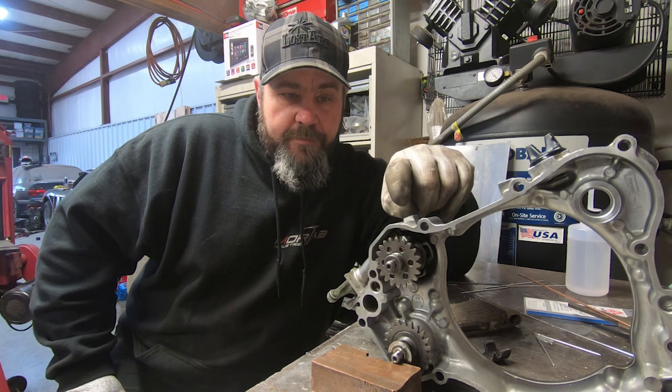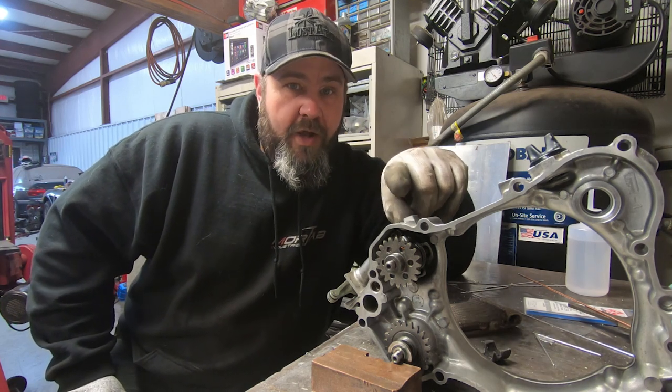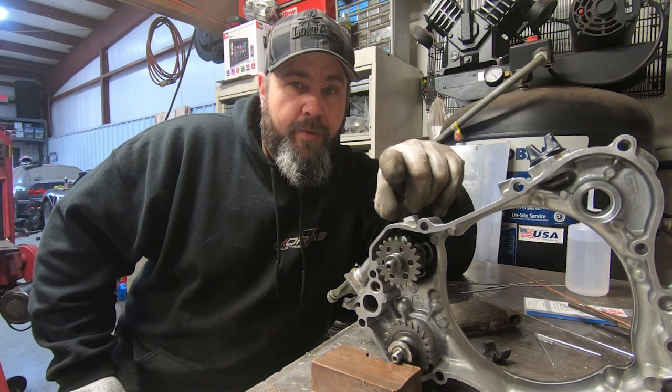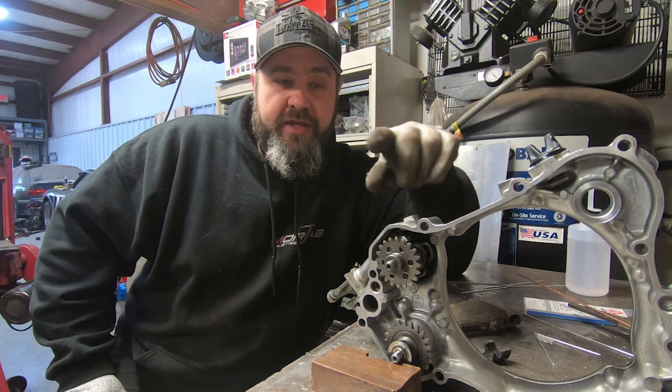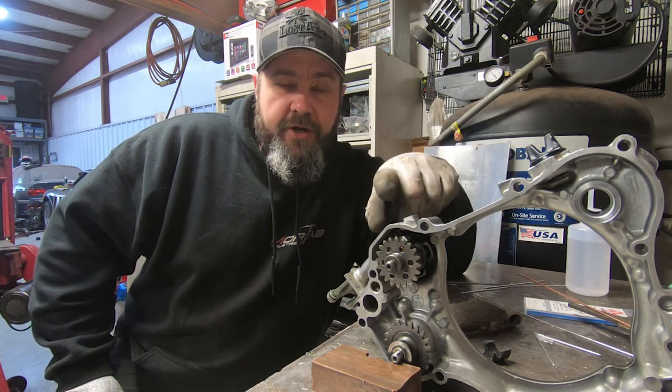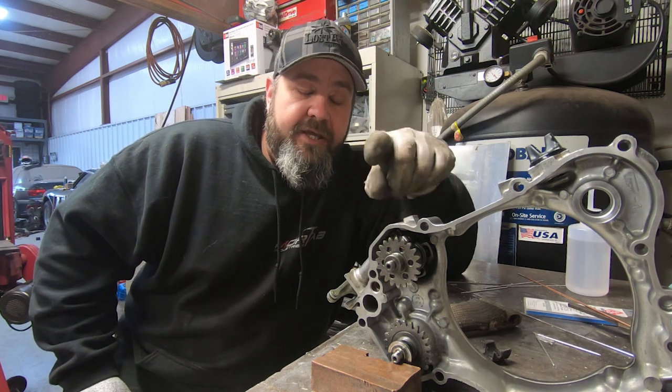and we're going to reflow all of this cast aluminum. And by reflow it, I mean when we start welding on this, what's going to happen is you're going to see a lot of pores and stuff popping out of it. You might not be able to see it, but I'll try to show you if I can get it to do it. And once we get all those pores out of there, we give ourselves a solid base to actually put some filler material in.